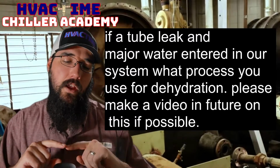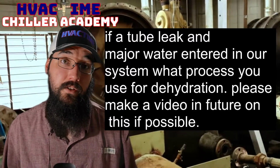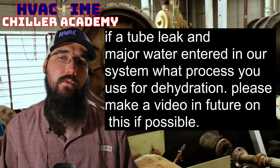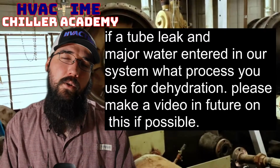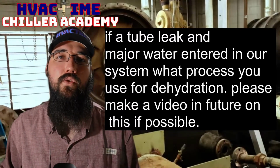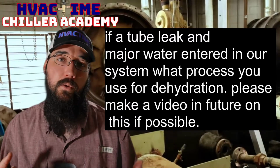But for everybody else, what you can do is, once you plug the tube and you've got a low pressure, it means you've got water in the system now. You're going to want to do a recovery and try to clean that refrigerant. That means either doing an on-site recovery process, or a recycling process on site. That'd be one option. Somebody like RefTech has some really good equipment to be able to do that on site. In some cases, like for myself, I've even gone to the point of let's just go ahead and replace this refrigerant. So we pulled it all out.